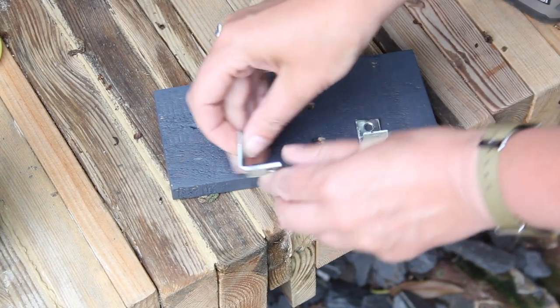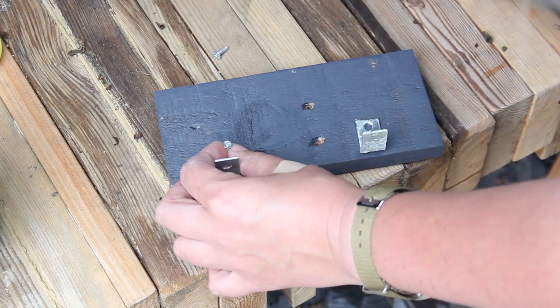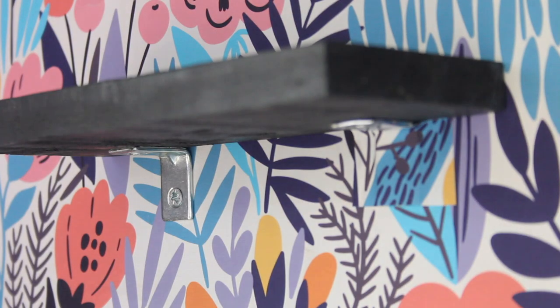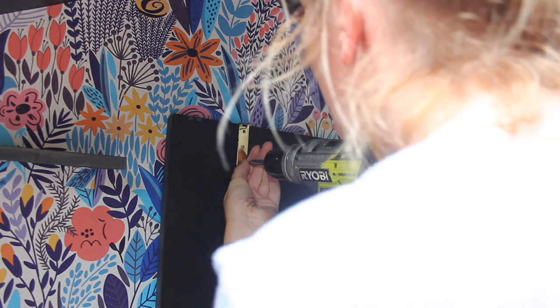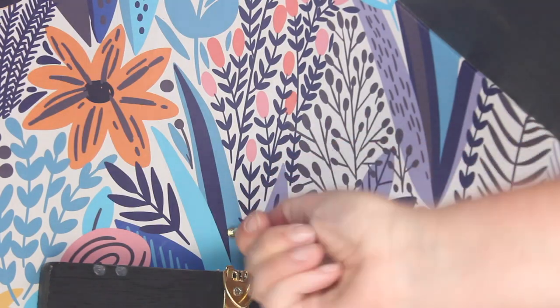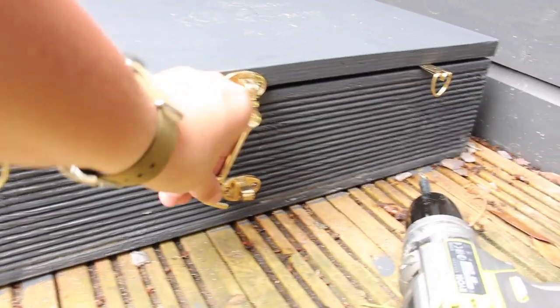It's time for the finishing touches. This is just a piece of pallet wood painted the same colour, and with two little brackets you screw the bracket to the plank and then to the back wall of the playhouse. To hide the brackets, I'm using leftover pieces of the vinyl wallpaper. To keep the lid securely open when Kiki's playing in the sandpit, I'm attaching D-rings to the inside of the lid — the kind you normally use to hang pictures. Then drill a little hole in the back wall and screw in a cup hook so the lid is nice and secure. I also added a hook to close the sandpit when it's not in use.